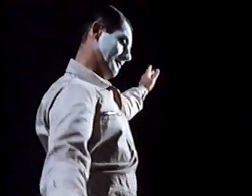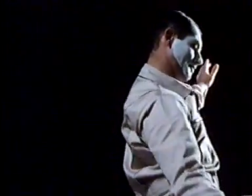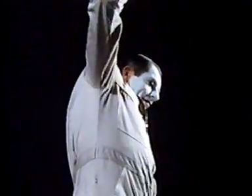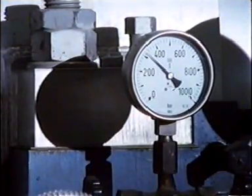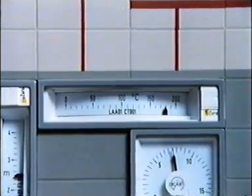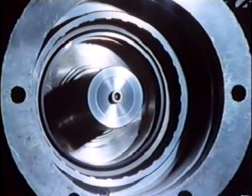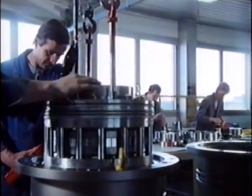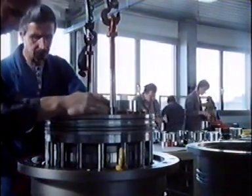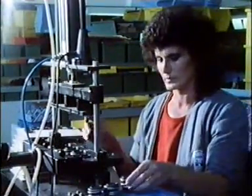It can be quite a problem for the lubricating film to maintain the balance, to remain stable, as there are several factors in practical operation that influence the stability of the lubricating film. The medium, pressure difference between inside and outside, high and low temperatures, high and extremely high speeds. The large number of different mechanical seal designs matches the influencing factors and their numerous combinations. Whether it's a specially designed or mass-produced mechanical seal, the range of application is indeed very wide.